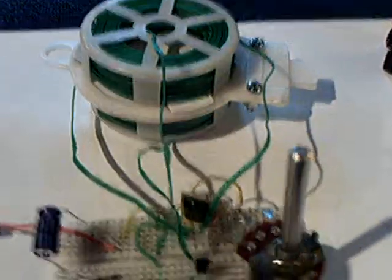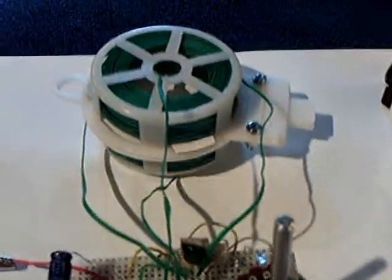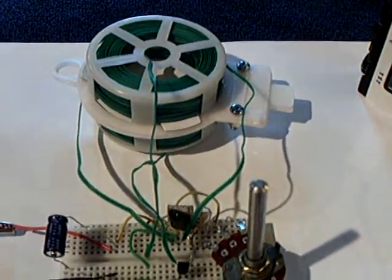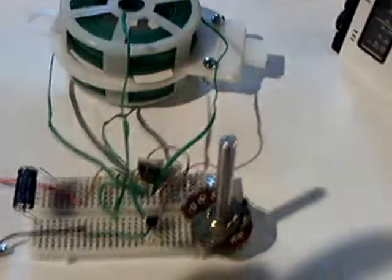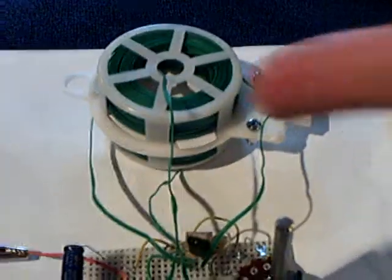This cell here not only works on visible light, but infrared light, and I'll show you the little oscillator here. It's just one of these blocking oscillators — I've shown them in other videos. There are different names for them, but they're basically a buck-boost blocking oscillator circuit. I'm just using a twist-type steel wire for the coils. I've got a radio here so you can listen to it.